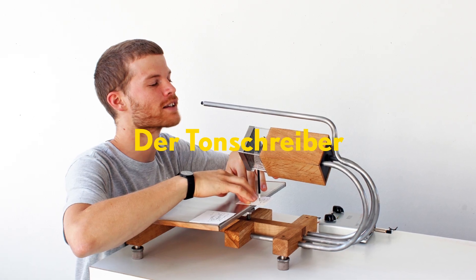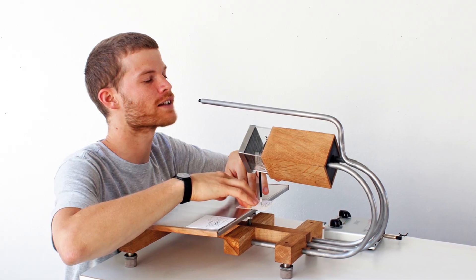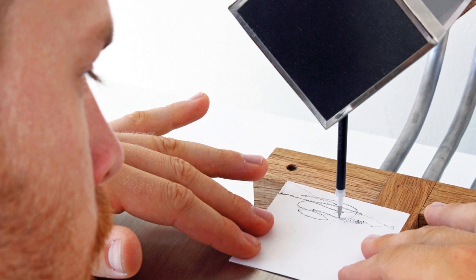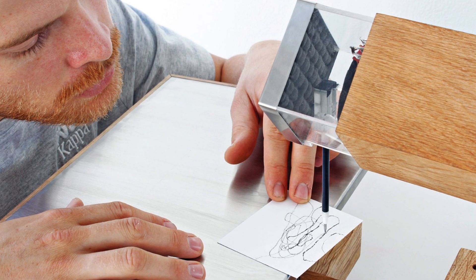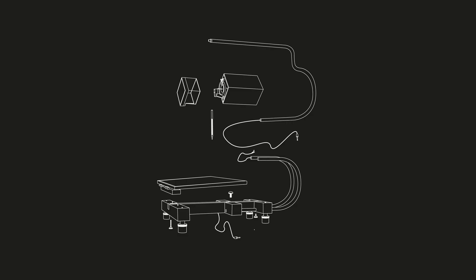Anyway, let's get back to my machine. I built this machine in 2018 and gave it the name Der Tonschreiber, which is German for 'the sound writer' or 'the sound recorder.' My actual intention was to design a musical object that could be used as an educational tool for workshops. Inspired by the sound writing machines of the 19th century, I constructed this simple machine. The base is a wooden frame to which all parts are connected. A ramp sits on the frame, which presses the paper at a slight angle against the tip of the clamped pen.